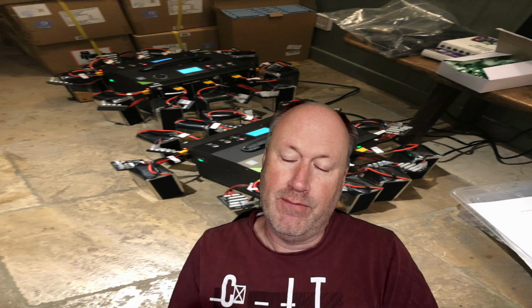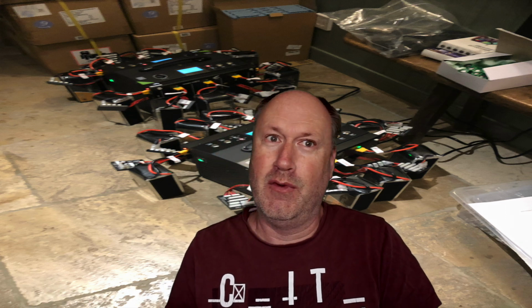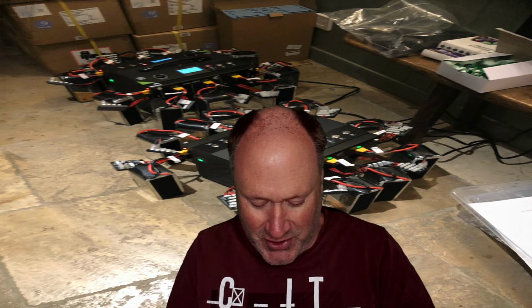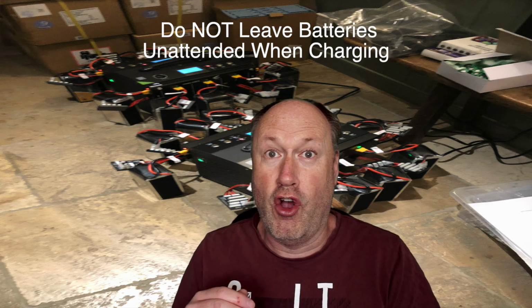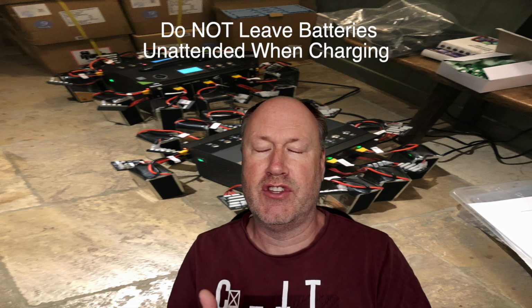It's really funny, it was me and Andrew, both from the model flying community. We were like, no. Do not take LiPos down to 10%. Get down to about 20 and stop using them. We're getting to that. But yeah, what we used to be taught was wrong, I think. They did change what they were teaching.